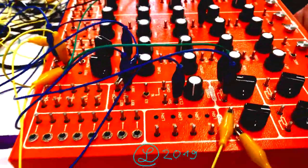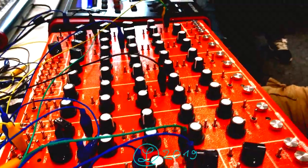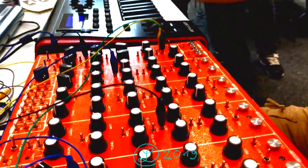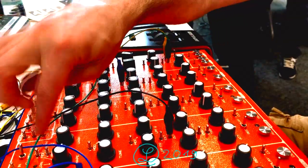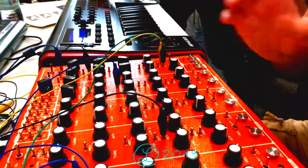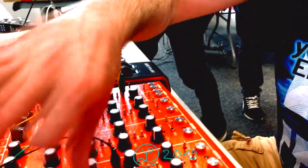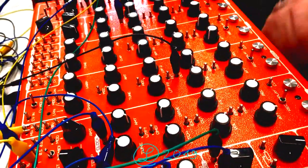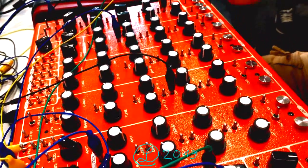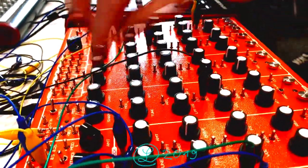These are analog sources. What we have digital here is just a DSP processor — that's also a very powerful part of it. We have a digital DCO on the bass and percussive channel, but this DCO is pure math synthesis — no wavetables, no samples. It's a DCO plus analog filter and analog envelope generator. You'll hear it's really hard to say this is a DCO — it's a really raw, intense sound, because of the analog filter, amplifier, and a different way of synthesis.